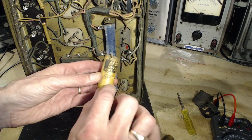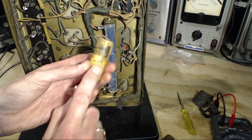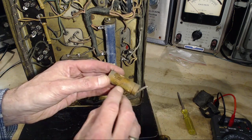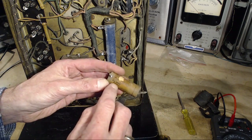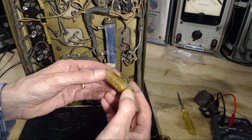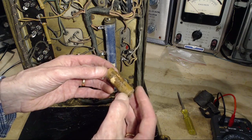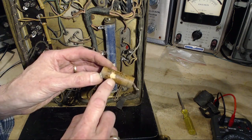Yeah, so they would have written the voltage down here and another down here, and so this is a 20 microfarad capacitor. This guy, what's that? Somebody's written on it. Looks like 450. DC peak voltage, handwritten 450. Under US patent. Where's the value here? MFD, and there's the value right there.